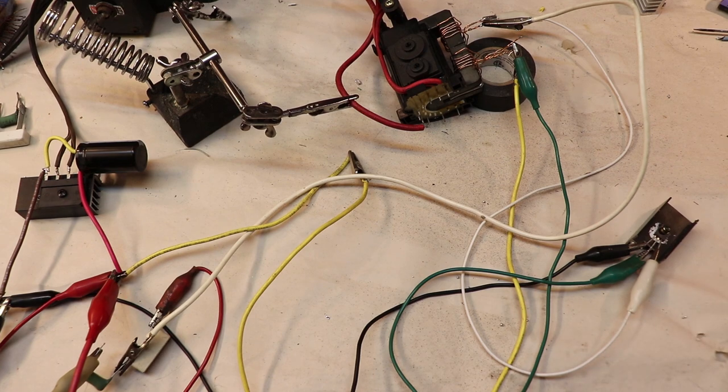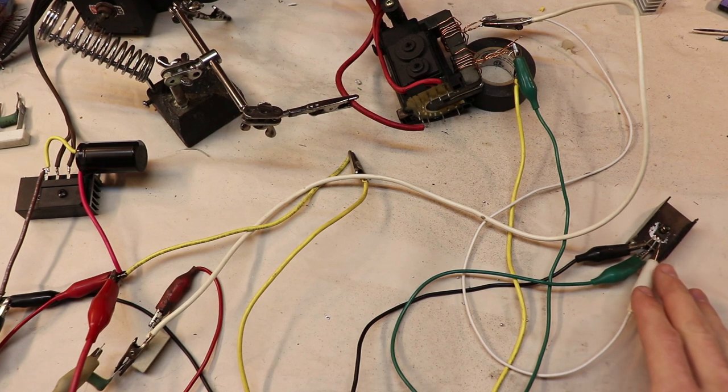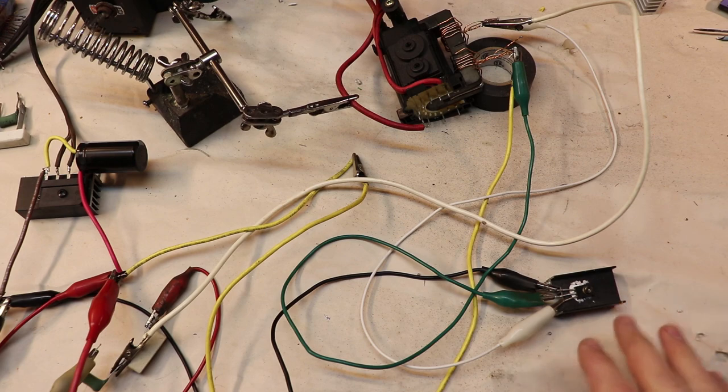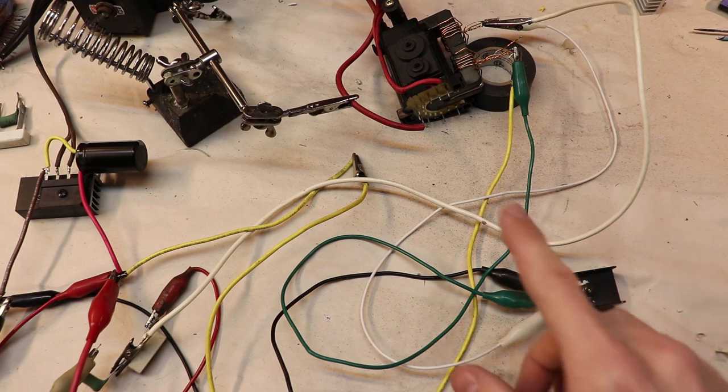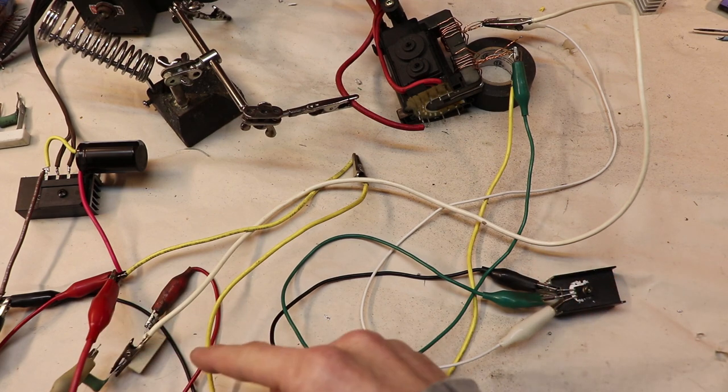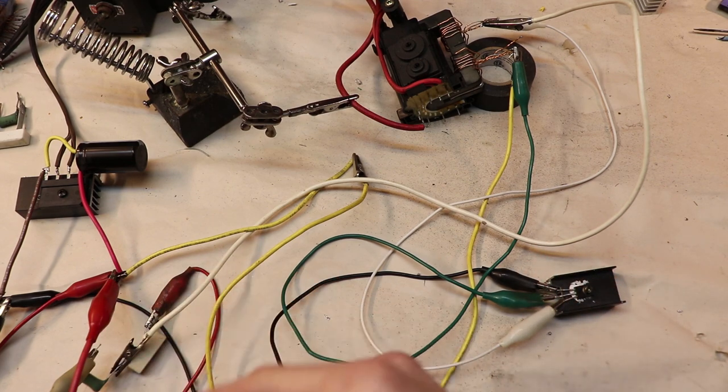So to demonstrate that, I took off the 2N3055 transistor and I replaced it with this transistor. This is a BD135 transistor, and I did find this transistor on a board and extracted it. This transistor is also easy to drive, and the performance that it puts out is actually amazing. Also, keep in mind we're using the same valued resistors from the original circuit.